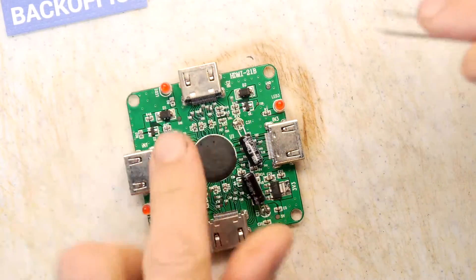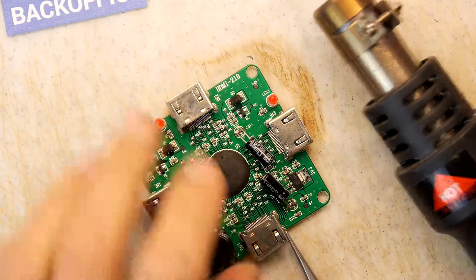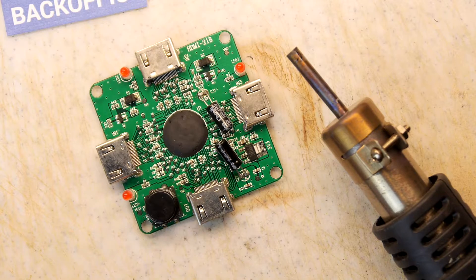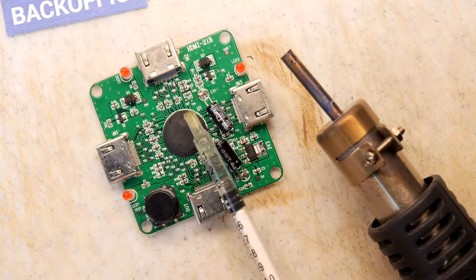But I kind of like the idea of trying to get off an HDMI doofa. So let's find my hot air blaster - I haven't used it for a while. There we go. Here he is. It is a he. I'll just turn that on and we'll get a bit noisy in here, and I'll find some flux and we'll see what we can do. I'm going to be using crap flux. This is a basic liquid flux, which is really quite useless for most things. I'm going to try to draw it into this tiny, tiny syringe so we have a few mils to play with.